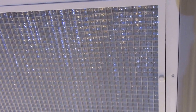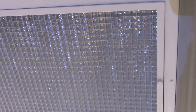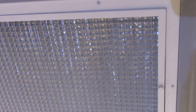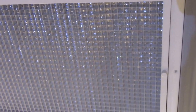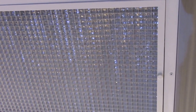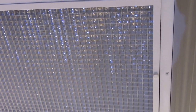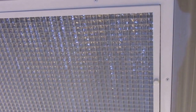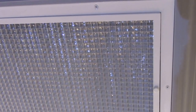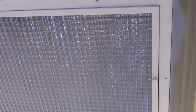I don't know when that furnace was installed, but they had an insulated duct yet the sheet metal plenum was uninsulated. I guess back in the day they didn't worry about that sort of thing. Now I have this system and I think it works pretty well — a nice clean setup. Open in the summer for the whole house fan, insulation panel in for the winter to seal it up, and if I ever need the furnace, pull that out, slide in the filter, and turn the furnace on. Of course I still have to light the pilot light.